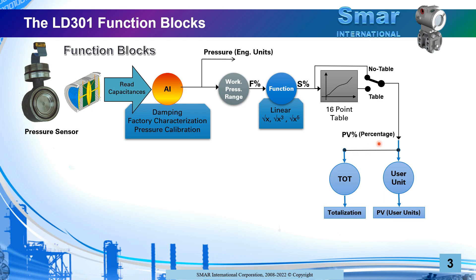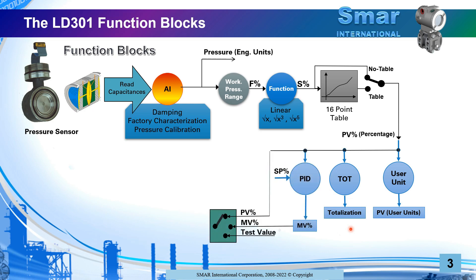From the same PV percentage, if this has to do with a flow measurement and you are measuring flow, maybe you want to do a totalization of the flow — converting how many gallons are passing through a pipe. You can configure the totalizer, and it will keep the variable inside the transmitter while the totalization is done in liters, gallons, cubic feet, or similar units. As an addendum, if you lose power, the totalization is not lost — it is kept there, and as soon as power is restored, it continues building up.